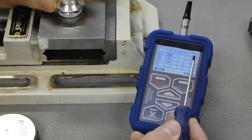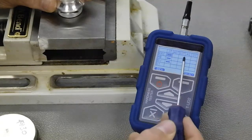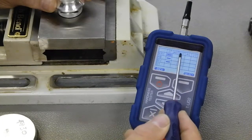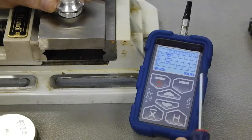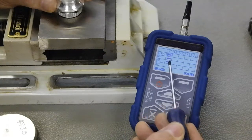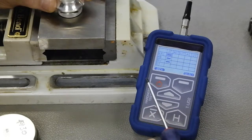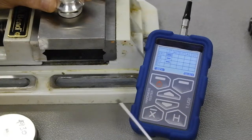So if you've got some material that is very hard and doesn't fall into one of these other groups, you can actually define your own, or even just use these ones but refer to them as a different material type. The little squares in here mean that these have been calibrated. The blank ones mean that they have not been calibrated. I'm going to do a recalibration just for steel and for HRC — it really applies to any of the other ones as well.